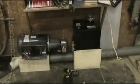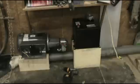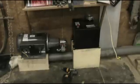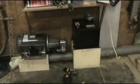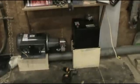Been plugging away at this project for a while. Got all my descriptions of the hoses we need, and we're going to have to upgrade the wiring — what we have now is 12 gauge, got to go to 10 gauge to handle the 30 amps that this 7.5 horsepower motor is going to demand.